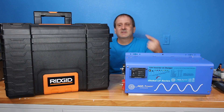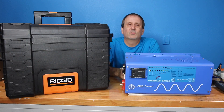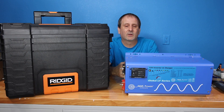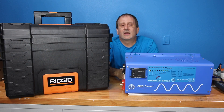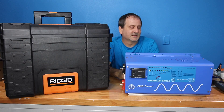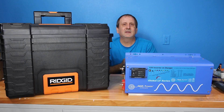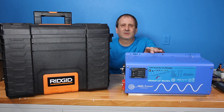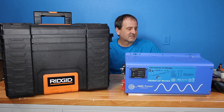I'm going to put a boatload of those batteries in this box with this inverter and a couple of other components. This thing will run whatever you want — it won't run a whole house AC, it just doesn't have the power, but it will run a mini split, several window units, your refrigerator, all your lights, and a ton of stuff. Pretty much a whole house minus the central AC. This is 120 single phase so you can't run 220 out of it, but you can run window units.